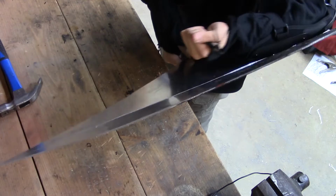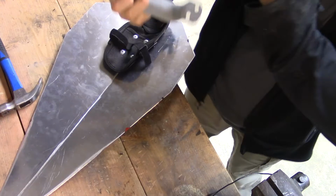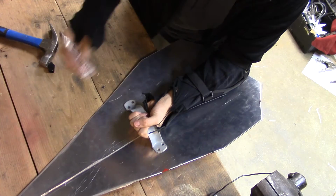Next, you're gonna wanna bend the handle to the contour of your shield. If your shield doesn't have any contour, then that's easy, because it's gonna be how it is, but this one needs to be. Now, once you have your handle contoured in a comfortable position, we're gonna strap in and hold it where you're gonna wanna drill the holes and rivet it, and just mark out the center of those with a marker. And the marker actually works this time, because I'm not stupid.